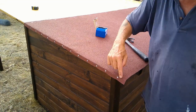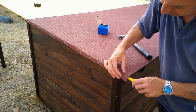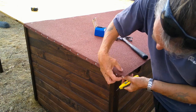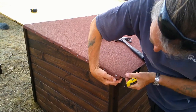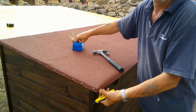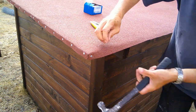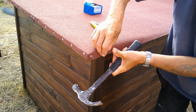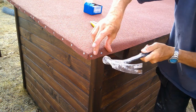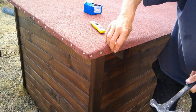So we've done down this side and now we get to a corner. Obviously we want to keep them neat. I don't put a 45 degree cut on them, I just put a straight cut like that, tuck it down there, and then over we go — we've got a nice neat corner. So I've nailed that in and then we just carry on down here. It says every 50mm you're supposed to do them — two inches. I'm not measuring them, I'm just guessing them.